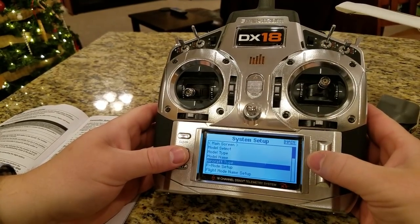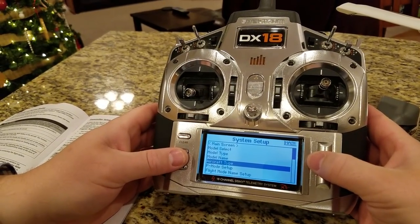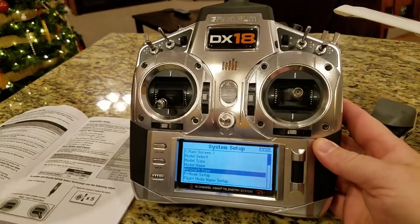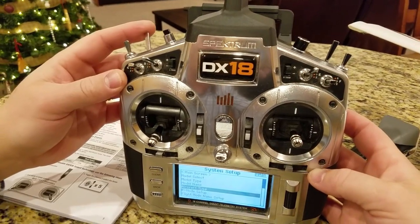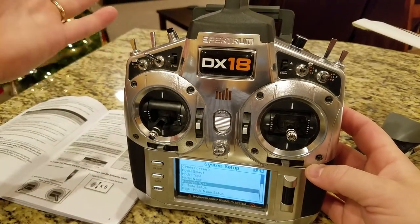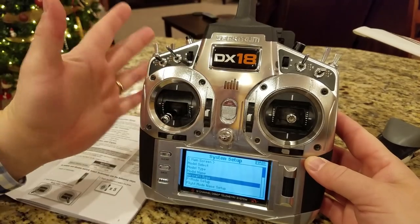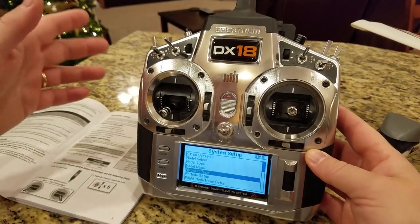Okay, so now, leave all switch settings at their default values. The gear switch, channel 5, will control safe mode. Okay, fine. We can test that and reverse it after we get it turned on and off. I usually use the gear switch for safe, and then if I have panic, I'll use panic on the bind. I don't ever use panic, though. I hate panic because it doesn't unpanic for about 2 or 3 seconds until you let go. So you let go, and then it's like flying into the wall.